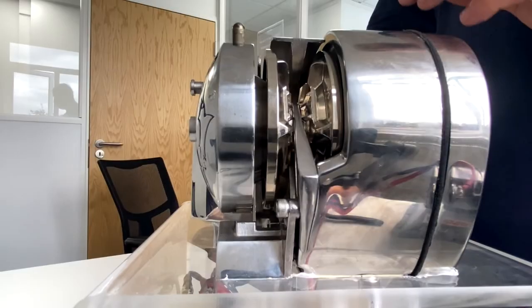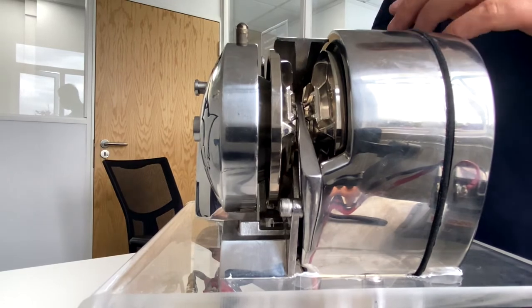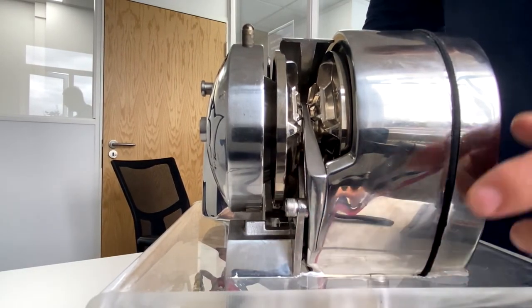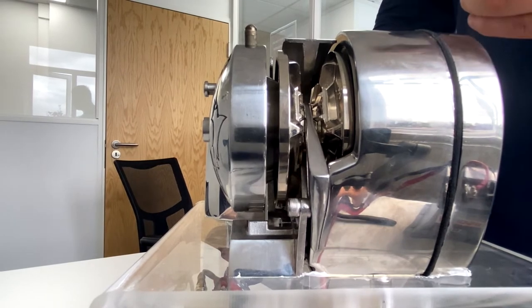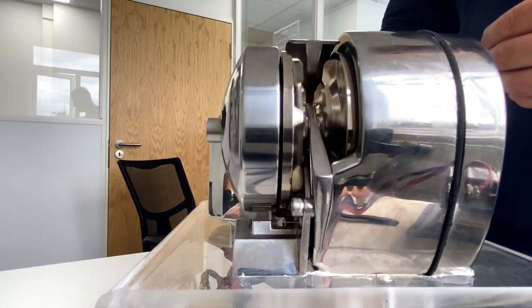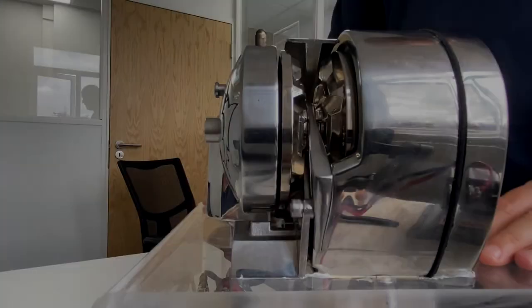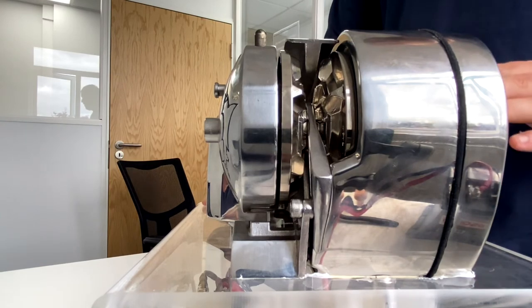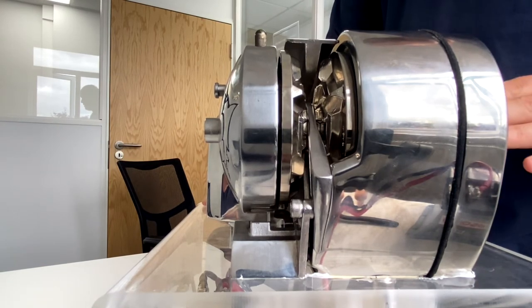To take out a free-fall, all you want to do is press the up button, meaning this pin will then hit the other side of the block, causing the cap to do itself back up. You'll know once the cap is done up, as the pin will start springing past the block, clamped down on the gypsy, and this will then pull up the chain.